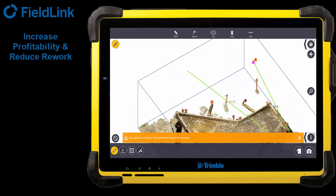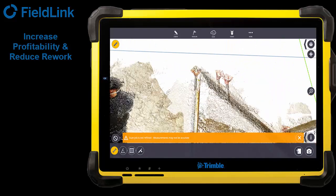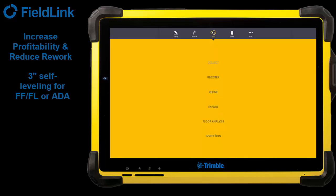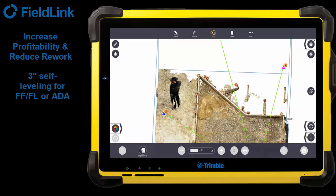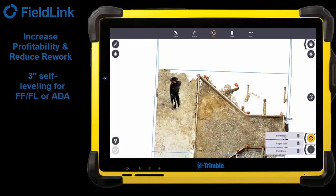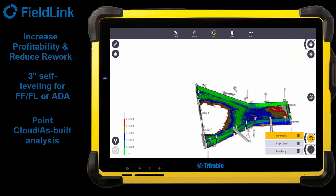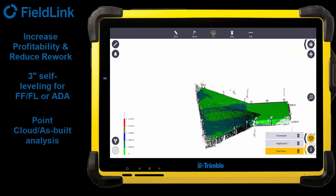This typically shows me the rise and run of the points I select. I can get a full distance, change in Z over standard or slope distance, and get my percent change to make sure my formwork is good. I can do this after the pour as well. I can also create a model or even a plane — which is pretty easy to create — and do a scan-to-model comparison for the formwork and then post-pour.